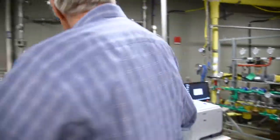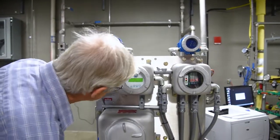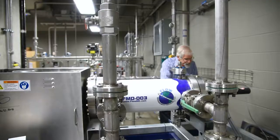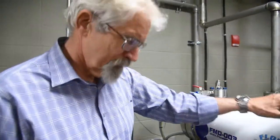The same amount of water running through the meter runs through the prover. If the meter says it's recording 9.8 gallons and the prover is reading 10 gallons — well, which is right? We make an adjustment on the meter to match what the prover is saying.